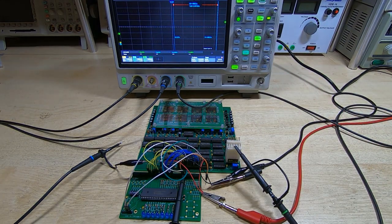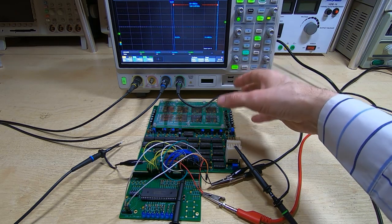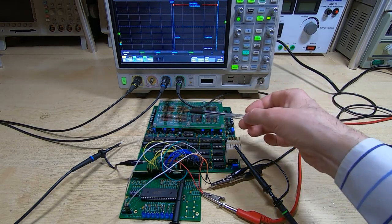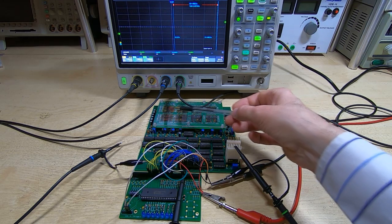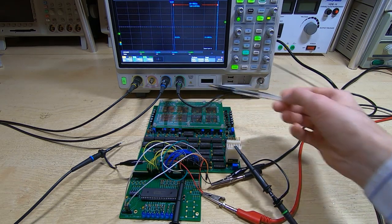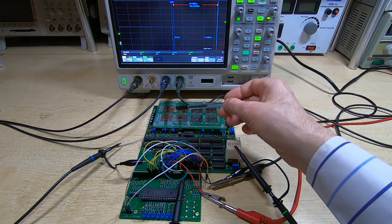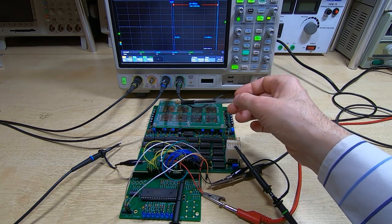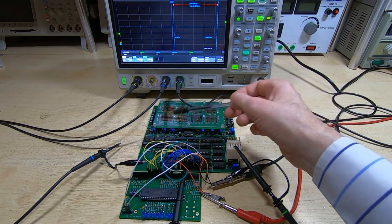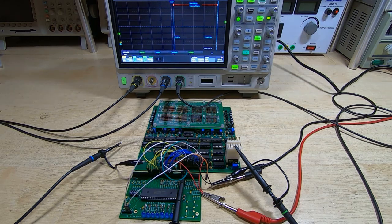But one of the complications in developing something like this that I'd mentioned previously was the variability in lots of different aspects of the operation of the system. So for example, if we take just one of these mats, so this is an 8-bit memory, and there is one of these mat arrays for each of those bits, and each of those mats contains 64 ferrite cores. So if we take just the first one as an example, then when we're trying to test this, every single core on that mat is handled by a single sense amplifier. So there's a single wire that runs through all 64 cores, and that means that any variability in the cores themselves has to be catered for by the sense amplifier.